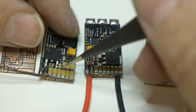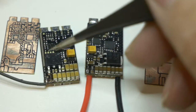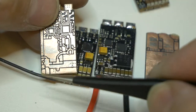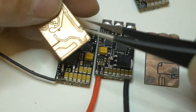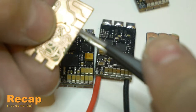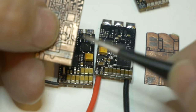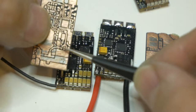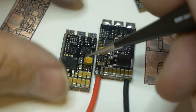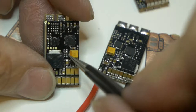This one here, as we figured out, this signal wire on the outside ends up going, let's do this slow and careful. So signal wire here goes over to the other side. Over here, runs up to here. Do the pinchy thing. Grab it. Wait. Oh my gosh, it's starting to shake. So it goes over here, and it ends up on this pad right here. Uh-oh, upset multimeter. Goes up over to here, which in this case is this 0402 little tiny resistor right in there.